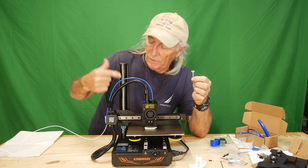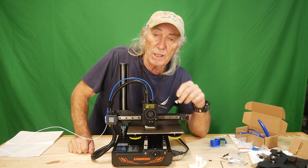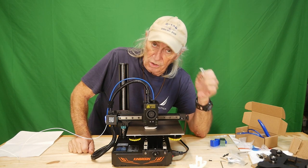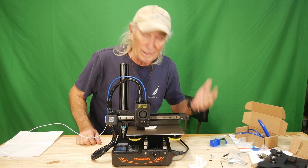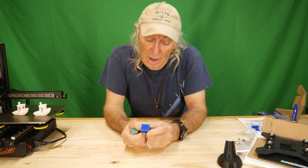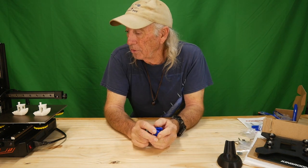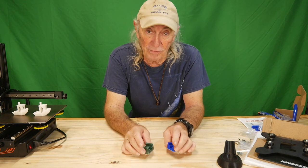There's one other mysterious part we didn't use — it's for adjustment of the Z-axis stop limit. If you use glass and put the sticky base on the glass and then the magnetic top, it raises the entire bed height. So you need to change to this piece so you can adjust your stop. That's worth mentioning. Other than that — linear rails, industrial grade. Don't you love it? I'll provide links in the description for where to get the printed blocks, the linear rail kit, and where to purchase the machine.